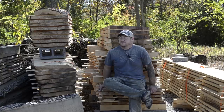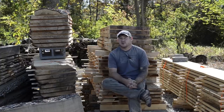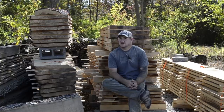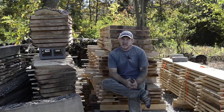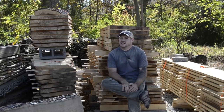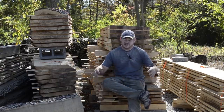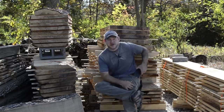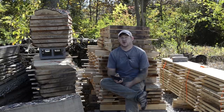But for example, that pine that I had an order for, I ended up with 19 boards that are live edge, both sides. They taper from about 14 on the big ones down to about 8 inches. The other ones are about 12 down to 7 or 8. And they're about 12 foot long. So my rough calculation ends up being about 200 board feet or so. That's just me doing it in my head as I am walking. That's not even close to right. Okay, so after actually doing some math, I think it would probably be closer to 250, 300 board feet